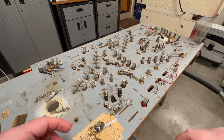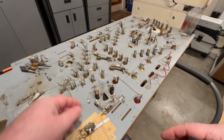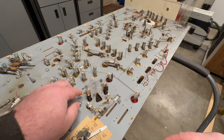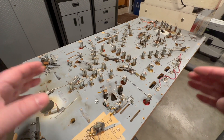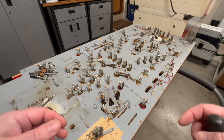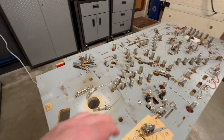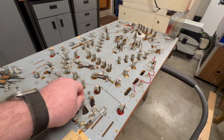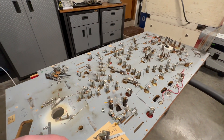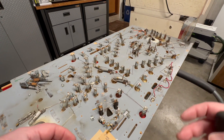As I go through and remove the harness, you can see that I've left a little snip of wire on each of these items — whether it's a lamp socket, a switch, etc. I've also taken very detailed pictures of the playfield as well as some HD video, so when I go to put this all back together I have those as a reference. As I bag these up, I'll bag this set of switches in one bag, this set in another — slingshot switches, pop bumper switches — so I have those as a reference along with the pictures. Most of these switches I'll just be recycling.